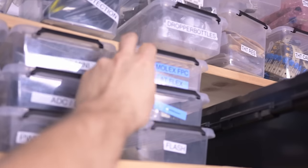Charger testing is concluded and it works. All the cells can be individually charged, they are all individually protected, they stop when they need to, they protect against over-discharge, and it doesn't seem they influence each other. We have a bit of a voltage drop, but not too much — we can still power the rest of the system with it.